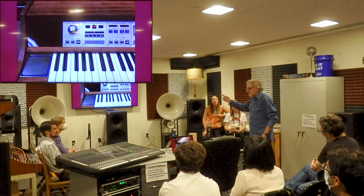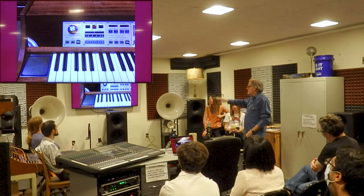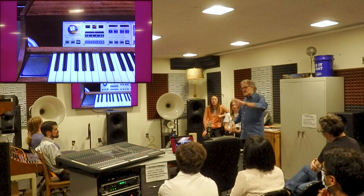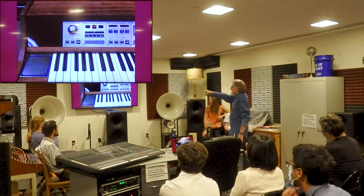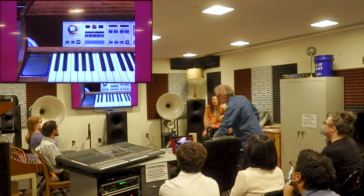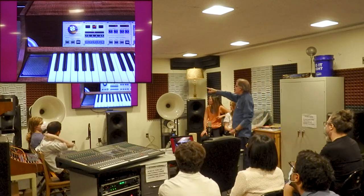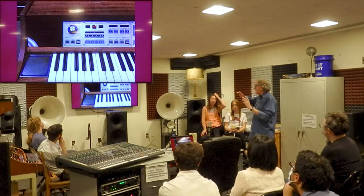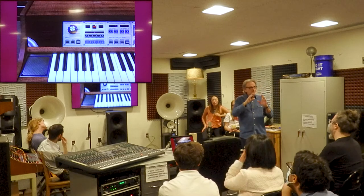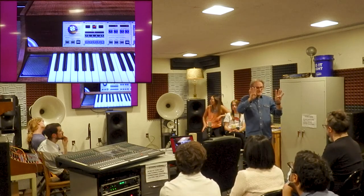So we started out by looking at, so the panel is designed from that point of view. So you gotta have a keyboard instrument, a master volume, right? And then buttons that determine whether you're playing or whether you're editing. And then the instrument, you could have two, what we call instrument definitions active at a time in the instrument. And so we had multiple parallel, not waveform generators, but wave shaping generators.